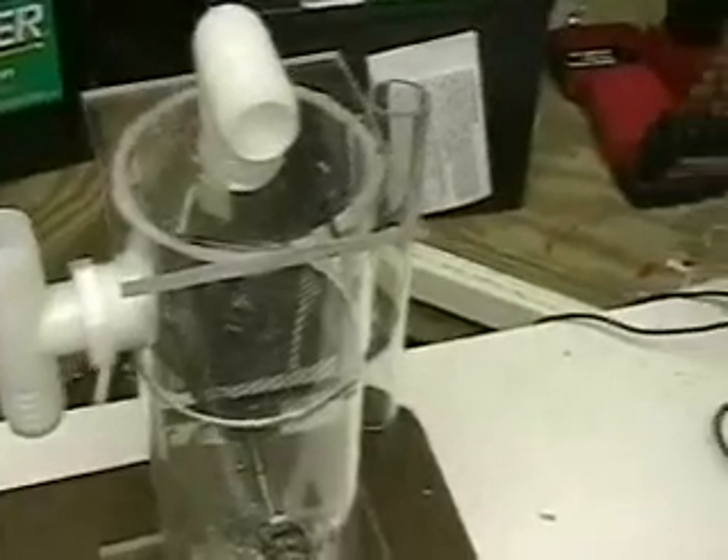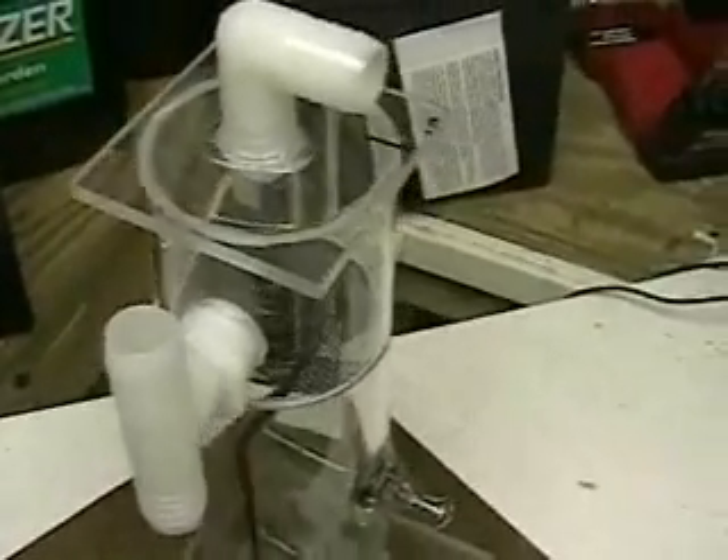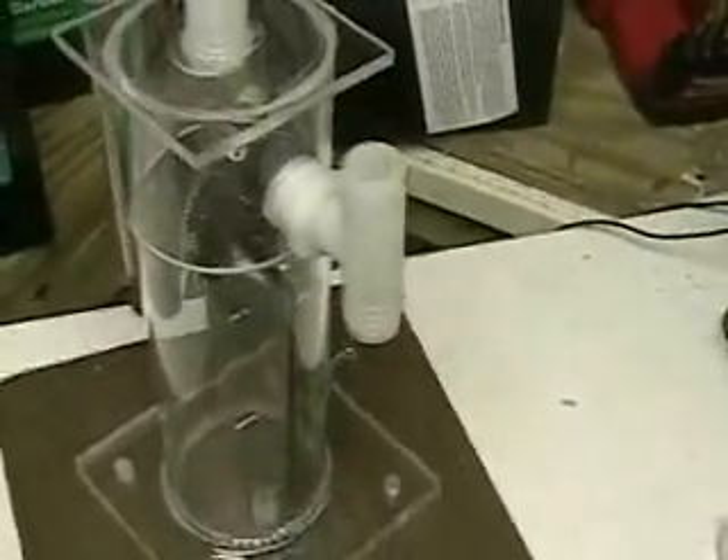You can see the screen inside that separates the hydrogen bubbles from the oxygen bubbles. The hydrogen bubbles are very, very small and go through that screen. The oxygen bubbles get trapped by the screen and are guided to this port, which allows them to escape.